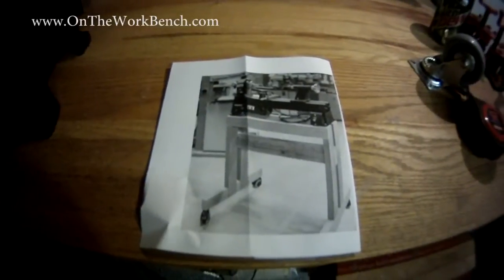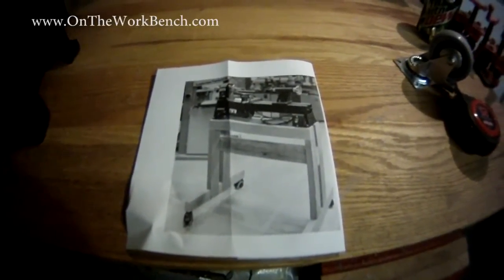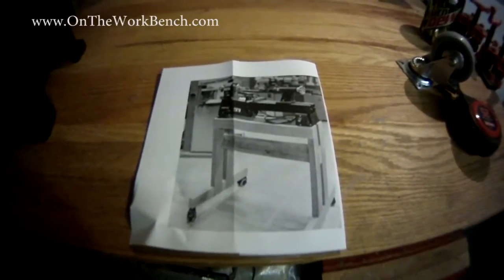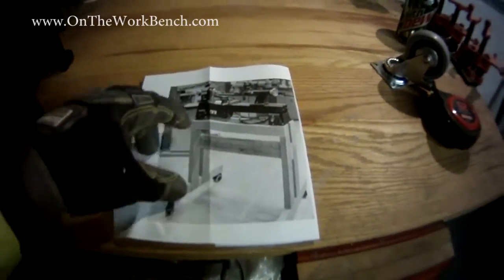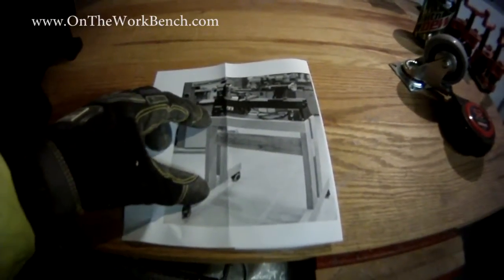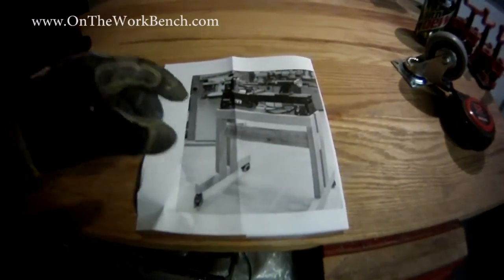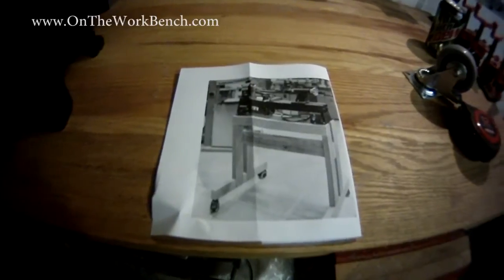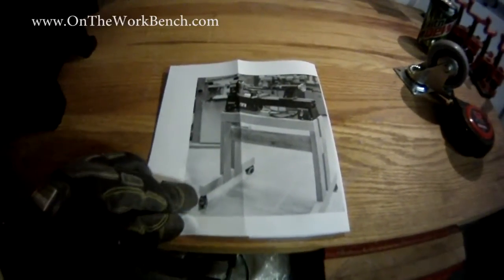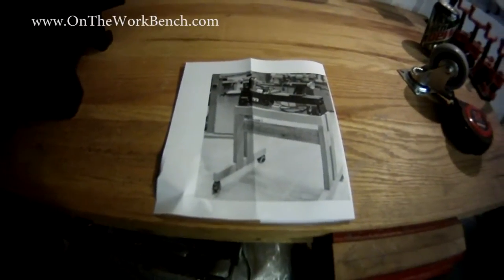The inspiration for my lathe stand here comes from Mike Laney, who's got a whole YouTube video about this, so I just did a quick screen grab of that, and I'm going to use that in my workshop here as I try to lay out my plans. It looks like, based on my height, I'm going to want these legs to be approximately about 24 inches. He made his out of 2x4s, I'm going to use 2x6s. I've got a bed extension for my lathe, so it's going to be a little bit longer, a little bit heavier. It won't be exactly the same thing. I'm using plate casters rather than just screw-in casters. I'll put a link to his video below in the description.